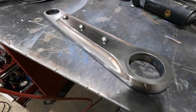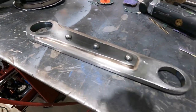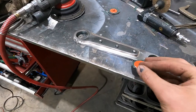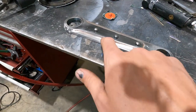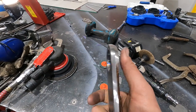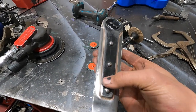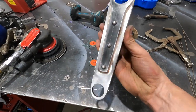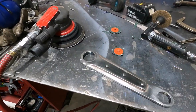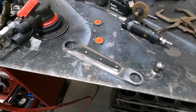After a little bit of sanding and blending, which I've shown on previous videos, basically just your roll-lock wheel, if you cut them in a square and leave them like this, they don't take so much off and they're very good for blending, especially where I've put this silicon bronze in here. What I was trying to do is just fatten it up a little bit. So now we have 15 mil where it actually mounts and then it comes down. I've done the exact same width diameter, 50 mil apart, just with a couple rivets. Looks pretty medieval, but I'm hoping once it's painted and on there, it'll really suit what we're trying to do. So now I'm just gonna plop that in there and weld it. And this is a job done on this one.